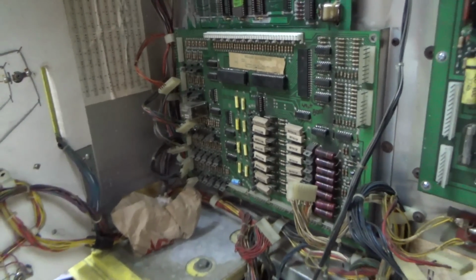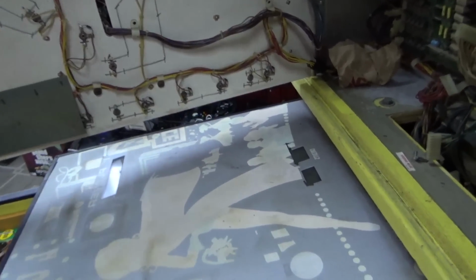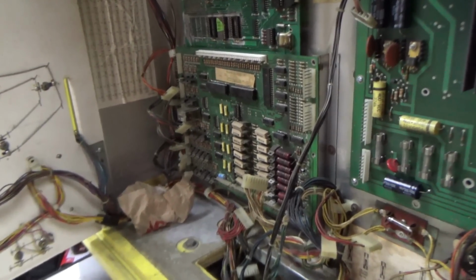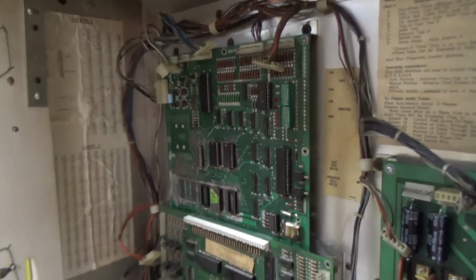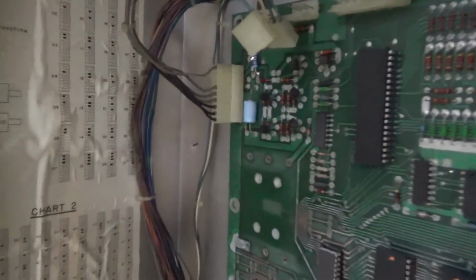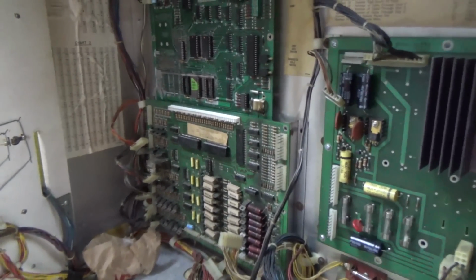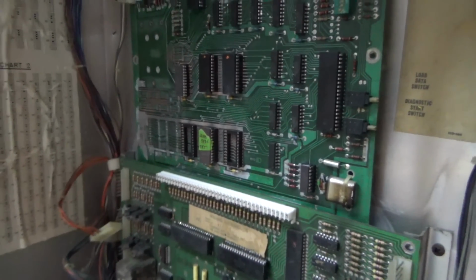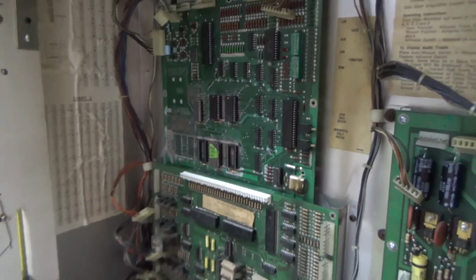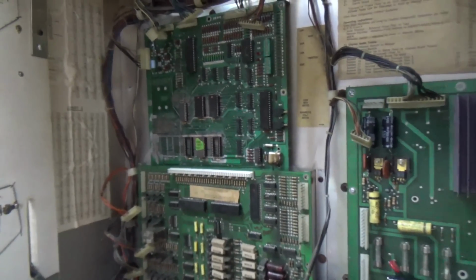Same thing with the coils. It's going to tell all of the coils to come on at the same time. It's going to pop 10 coils on at the same time, right? Or more than that, 15. So we don't want any of those plugged in, so they're all unplugged. If you're going to test it in the game, that's how you want to do it. So basically, we're doing it as if we're testing it on the bench. All we have plugged up is one power line to it. Okay? So when I turn it on, I don't know that it can even lock up Leon's test ROM. So it says won't boot, but I don't know that it can screw up his test ROM. It'll probably work. So let's see what we got.